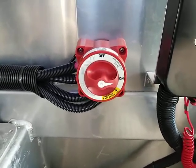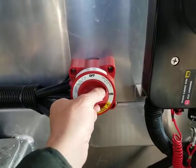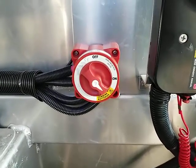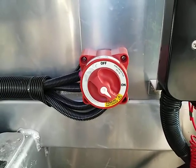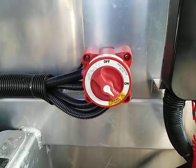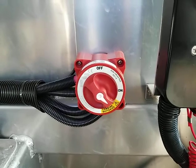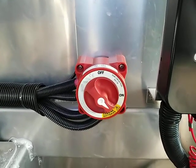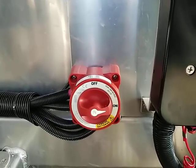If you find that the boat's not functioning correctly with the battery switch in the on position, the switch can be turned a second click to the position which says combined batteries. When in the combined batteries location, both batteries are tied together permanently to assist in an emergency start. The risk, however, is that if in the combined batteries position, both batteries can also be killed by running electronics. So unless something is wrong, just turn the battery switch to the first on position.